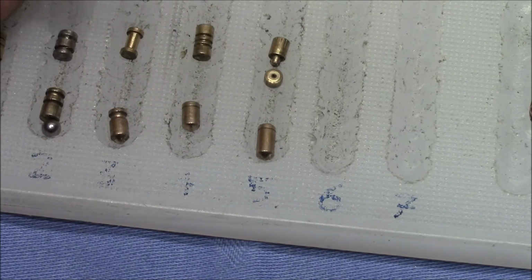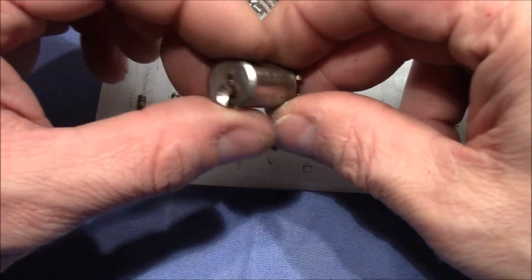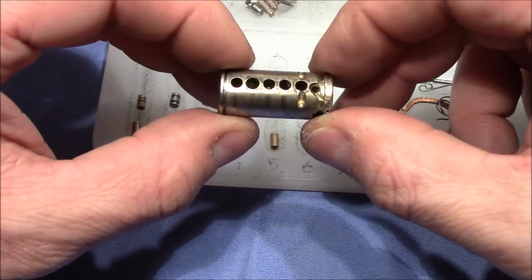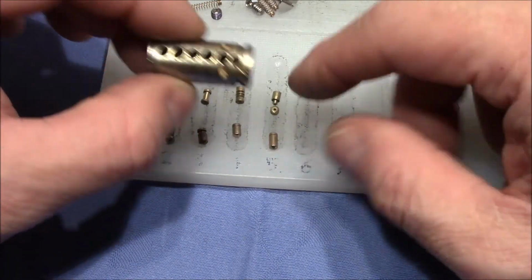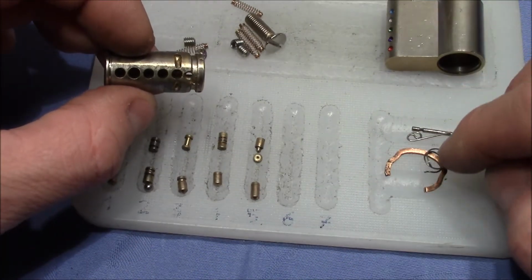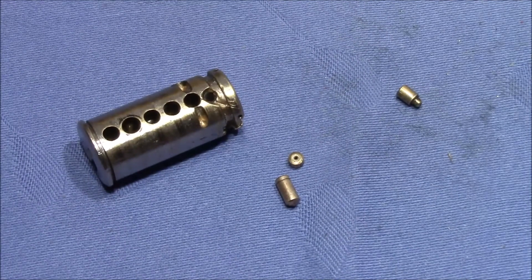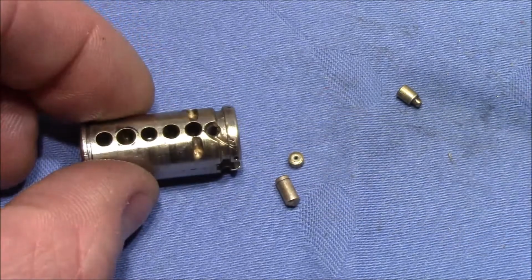As I said, I think I felt something like a check pin that needs to be triggered, and this mechanism here that prevents the plug from turning more than 90 degrees if you haven't pushed the stack number 5 all the way up. Let me think how this all works, and maybe it has something to do with the spring or so, and then I'll be back hopefully with an explanation. Alright, both mysteries are solved, the springy check pin mechanism and the rotation limitation mechanism.